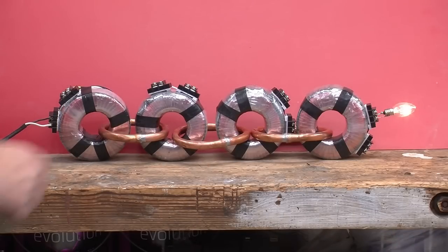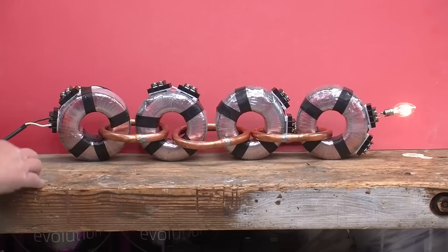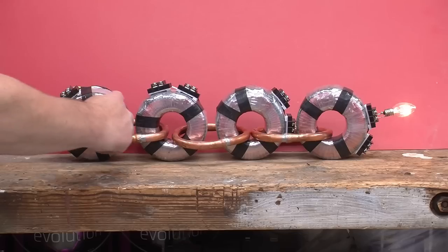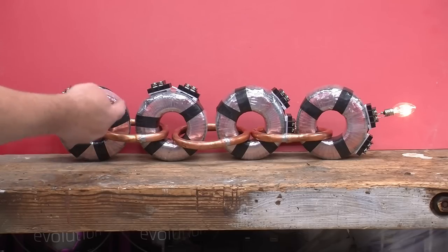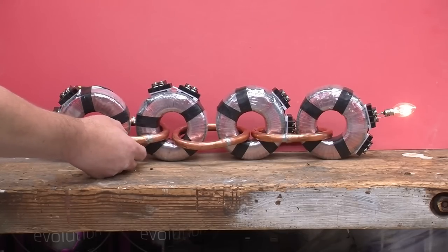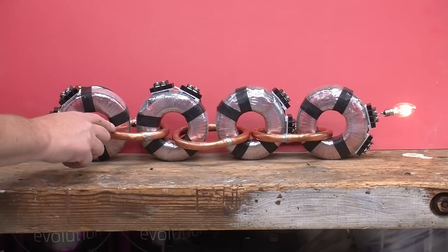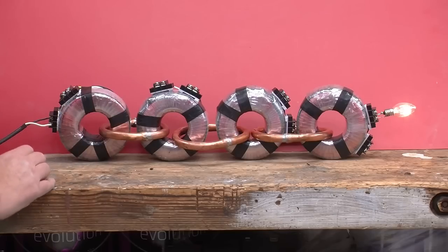So here's our EM chain and it starts with a toroidal transformer that is powered by 120 volts AC. And that 120 volts is going to about 500 turns of copper wire around the toroidal core. A toroid is really just a mathematical name for a shape like a donut. So 500 turns creating a magnetic field circulating in the iron toroid. Then I have a toroidal shaped copper pipe that is essentially forming a one-turn transformer winding connecting this toroid to that toroid electrically.